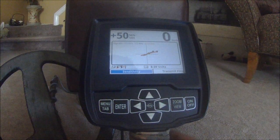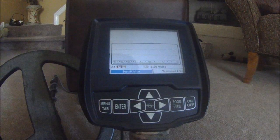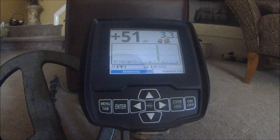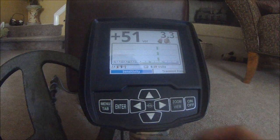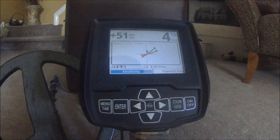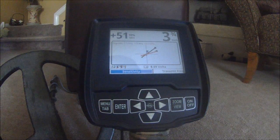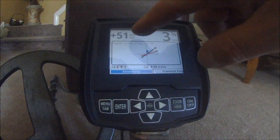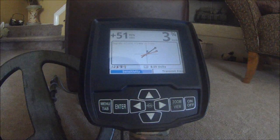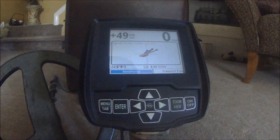What you're looking for — a target within the same VDI range, that positive 50 — I have a musket ball here. We'll wave that across the coil. I got a nice 52, our spectrograph bars are all in line, we have a good icon. Now let's kick into the Polar Plot by locking the trigger forward. We have a nice clean indication with all three frequencies separated, not bunched together. It's a positive 51 and our machine is 99% confident that is a good target — so that one we're going to dig, unlike that mess of the plus 50 from the round iron ring.